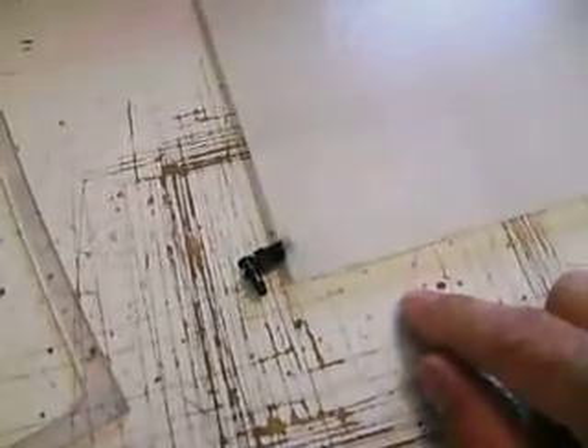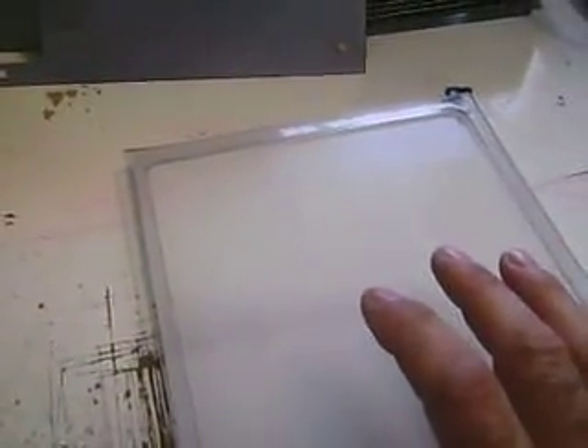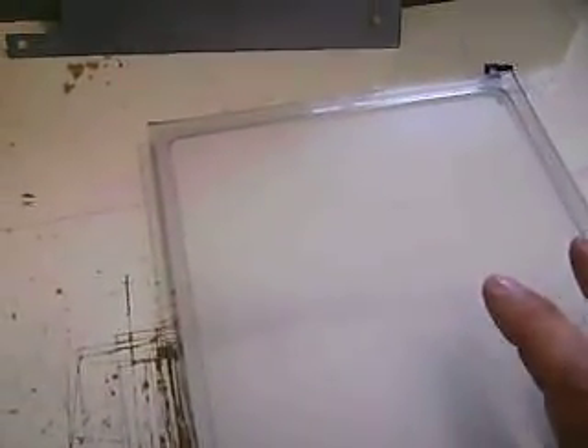This one's a little more complicated because when you've got two fittings, the holes have to be drilled at a very careful angle so as not to breach from one side to the other. That's craftsmanship — it can still be done by anybody, you just have to take your time. You're going to need a drill, a drill bit, and a really good eye. Because if the hole from this side and the hole from that side touches, you have just broken the isolation integrity, and now you have basically a wet cell design again.